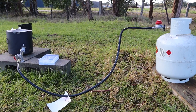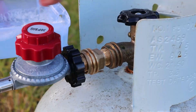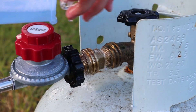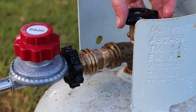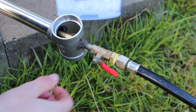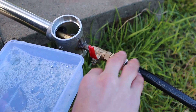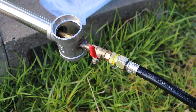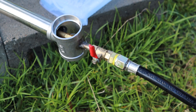You may think it's ready to start burning, but you'd be wrong. We first must do a leak test on all the gas connections. Get some soapy water and splash plenty of it around each of the connectors. Turn the gas on and inspect around to see if there are any bubbles. Make sure the gas valve is turned off, then cover the area in soapy water again. Turn on the gas bottle and the regulator this time too and give it a test. The first time I did this I did find some bubbles, so I added some PTFE tape to the connection and that fixed it right up.